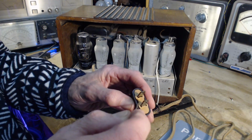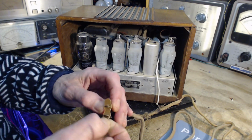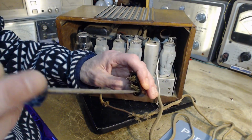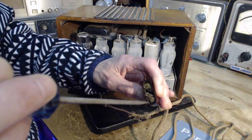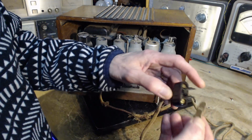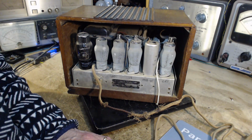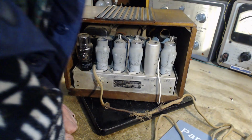Let's take a look at this. Do we dare turn this radio on? Now generally the instructions are no. You should never turn on a radio like this without doing some examination, but okay, so this is done fine. What I'm looking for are any loose strands or any chance of a short occurring, and because of the style of the plug, they've moved the connections way far away from each other. Well, these are tight. I'm sure that's not the original plug. Not polarized, of course. Great big transformer in here, so probably this only goes to the primary area of that transformer. Has a metal base cover, so this whole thing is a contained can, if you like.